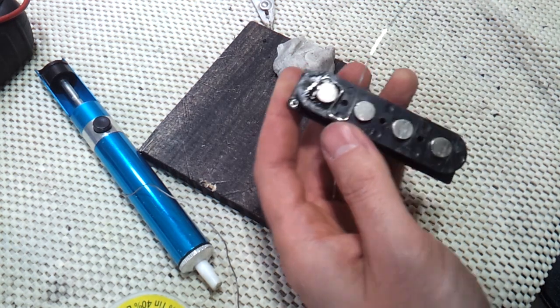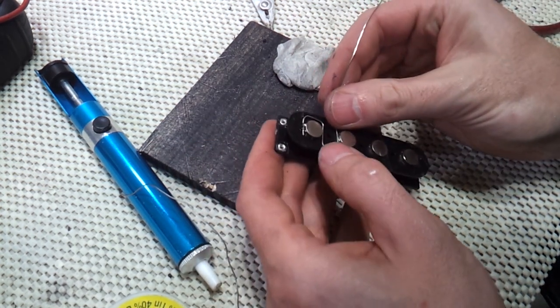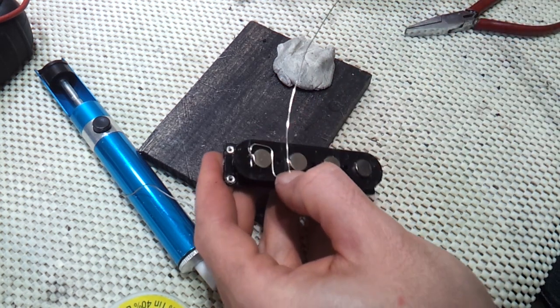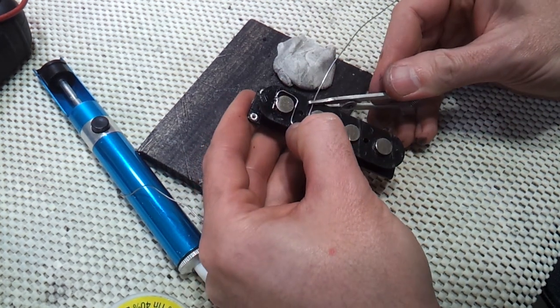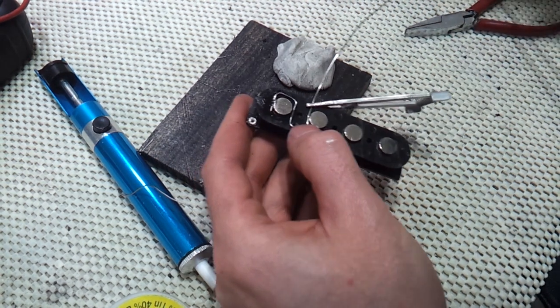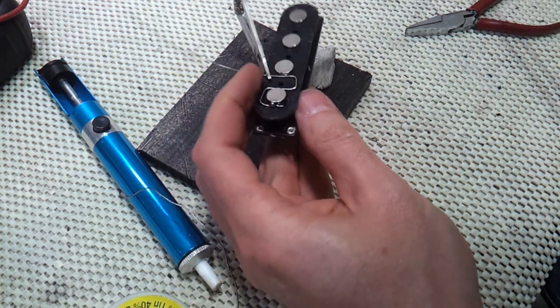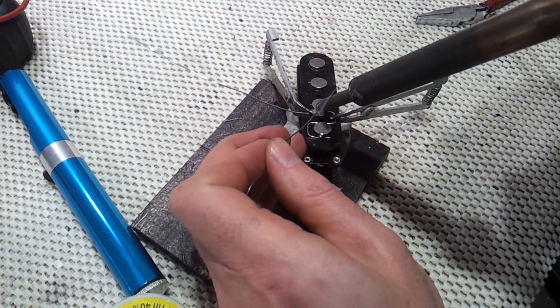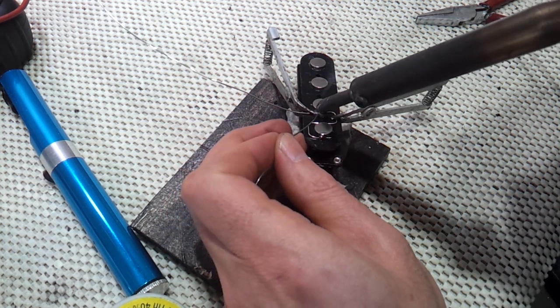Bear in mind that you can't solder to Alnico, so if you've got Alnico pole pieces, you'll need to earth them another way. That's normally done with a strip of copper tape, but in my experience, the conductive adhesive tends to fail over time. I'm not really sure why, so I normally use some combo of copper tape and conductive paint, depending on the bobbin design.